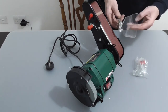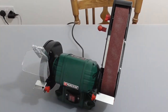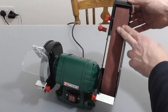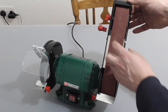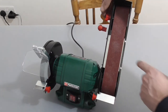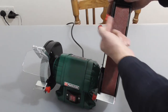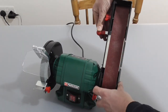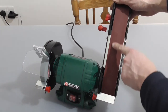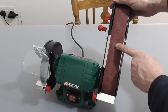I'll just put these guards on. So I've got my two guards on, ready to test it. But just one thing before you start the machine up — check that the belt is running through. If it's not, you can adjust it here for back and forward. This is how you release the tension on the belt. Please check that it's running in line, because if it's not and you start up the machine, it will destroy the belt in seconds.